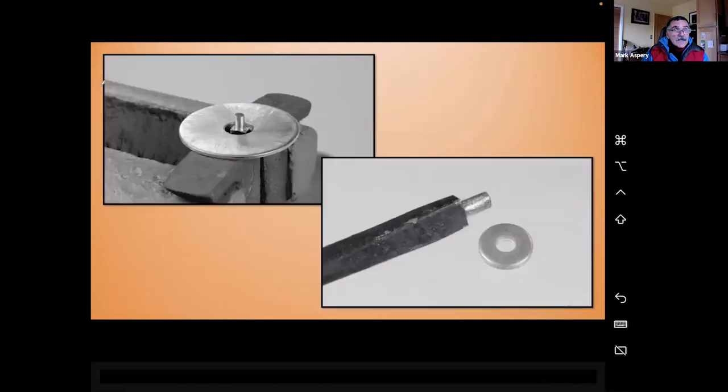You can draw the end. I would still do the T handle that I did before. And if you want a wood handle, then cut the T off. The T really helps when you're making the twist. Otherwise, it becomes a bit of a chore. So I've cut the T off if you want, and then I've just drawn a very lazy rectangular taper. Okay, and you can see that more in this photograph. That is a rectangular taper.